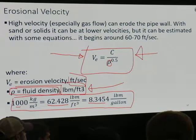What temperature are we going to use? The temperature in the line heater keeps changing. Am I correct? At one part it's hot, and after the choke it's cold, and we heat it through the coil, it's going up. Pressure also drops, but the pressure drop is a little bit small. It drops less than 20 psi per 100 feet. So Scott, what value of pressure do we use?